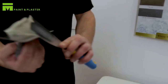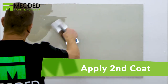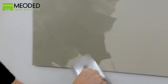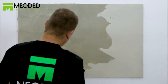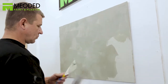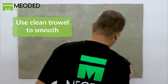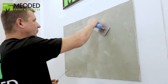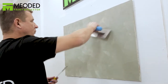With only a little bit of material on the trowel, apply the second coat. Work in square yard sections. Put material on the surface and clean — put and clean — repeating this action over and over. Now with a clean trowel, go back over each section to smooth the surface. Make sure there is no extra material on the surface, otherwise it will leave scratches on the finish. Be sure to clean the trowel as you go.